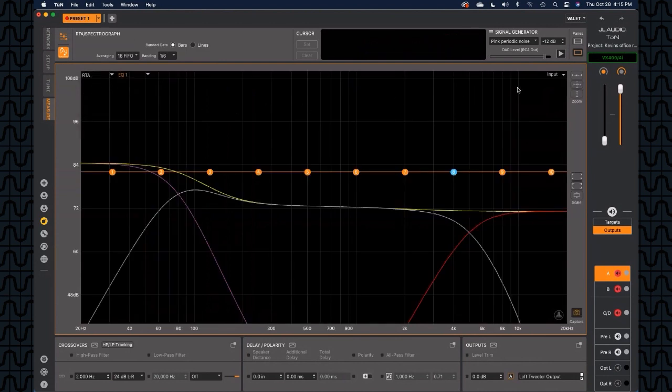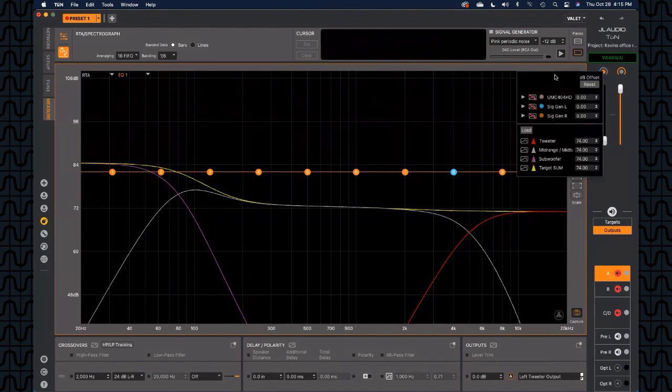We'll switch over to RTA. So now we need to do the same thing. In that top right corner, that's where our input selection is going to be. When Kevin clicks on it, we can see it looks like it's the first one. There's the sound card, but it's not selected. So go ahead and select it. Now it's got that green play triangle next to it, and its little icon doesn't have the red line through it. That means the RTA is now using this, in this case, the Behringer sound card with an XLR microphone. But we have nothing in the window.